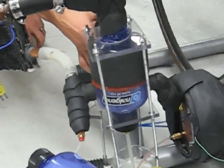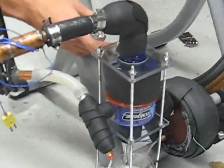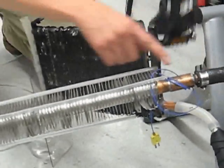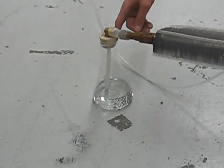The heat that's left from the condensation process enters into this top of the bottle, which is under negative 25 inches of mercury vacuum. That steam comes out into this tube and collects here. That water then goes into this collection chamber.